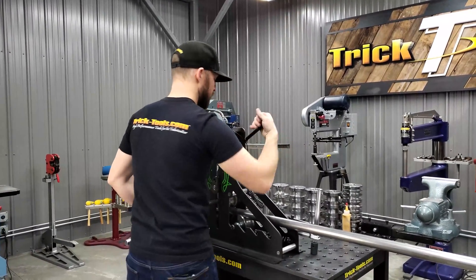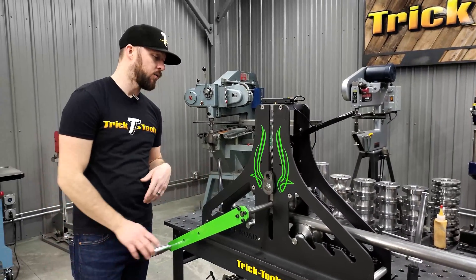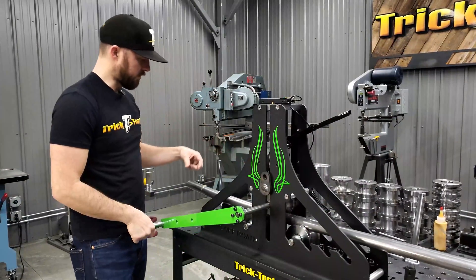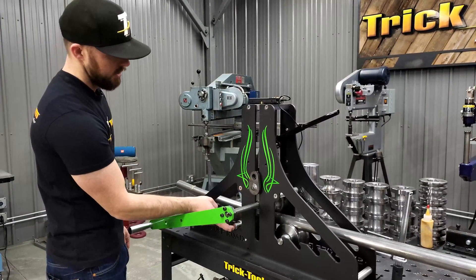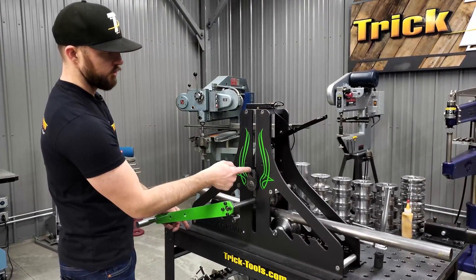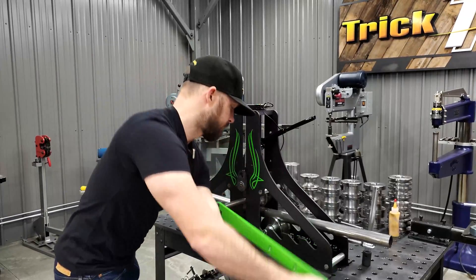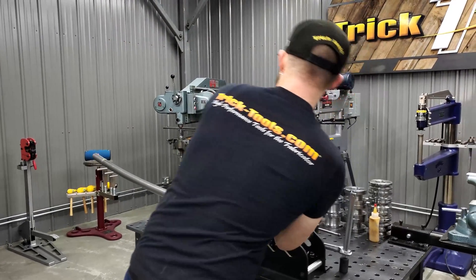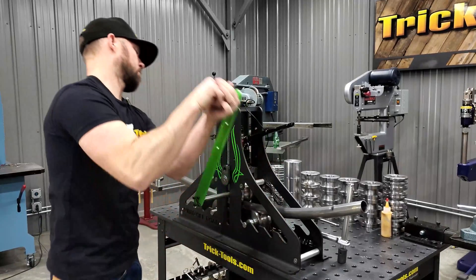Let me go ahead and put a little more down pressure on this. I've kept these rolls pretty close because this is — I think — 0.090 wall thickness, it's not too thick. The tighter these rolls are together on the machine, the closer to the end of the tube you can get as you're rolling. As you move the rollers out into different notches, the further distance there is from center to end, and the longer distance you'll have before the bend actually starts. You can see how quickly it's already rolling this tube.